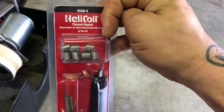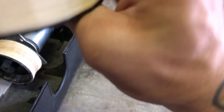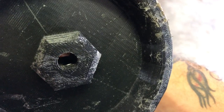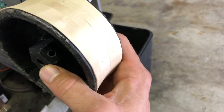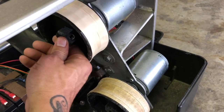The idea is to replace the plastic threads with a Helicoil — I linked it in my Thingiverse description. I only have a larger one right now but I've got one on order for quarter-inch 28, which is the actual thread size of this set screw. Installing it gives the plastic wheel metal threads, increasing the strength. I also put the set screw on both sides — if you strip one, flip the wheel around and use the other.